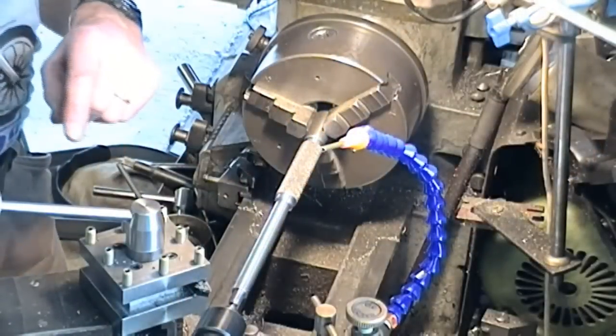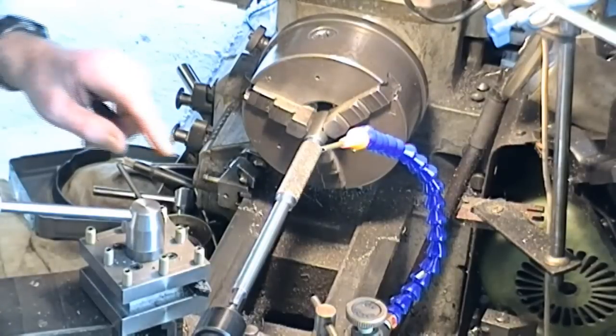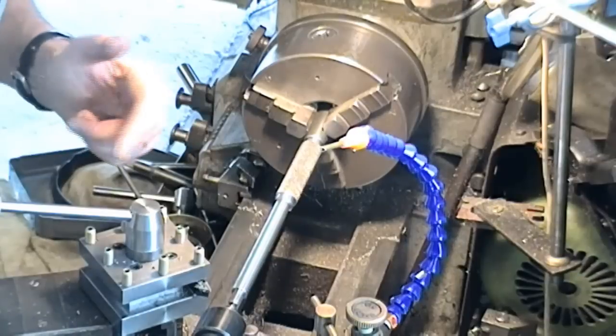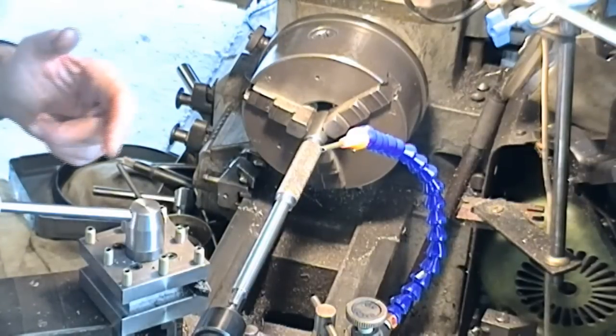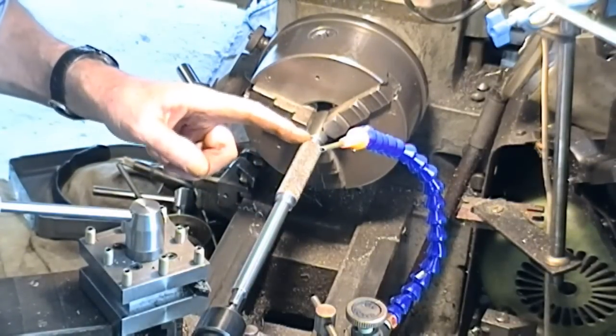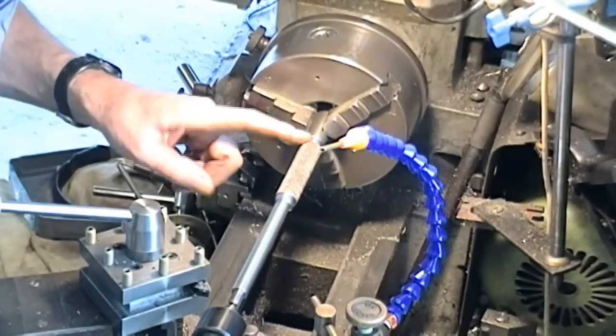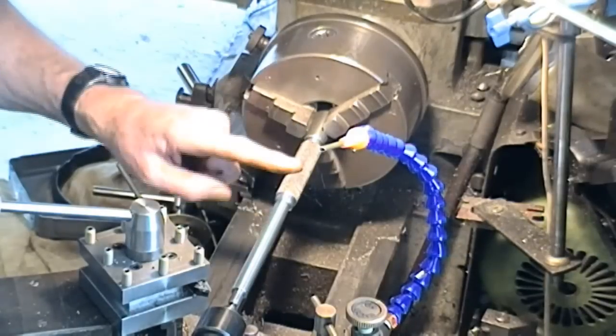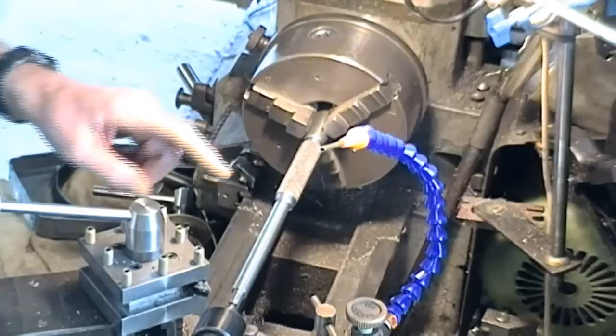That's a start on the first pass - another couple of passes will probably do it. I don't need to have the diamonds too pointy from a comfort point of view. I'm using the straddle knurler which I described in detail on a very early video. With this tool the side thrust on the spindle is very much reduced because the force is almost in a vertical plane - a bit of push but a lot of it is taken by the jaws. I think the fourth pass is finished and we're probably good to go. I've left that at half inch because I've got a fairly new half-inch end mill to make my pocket.